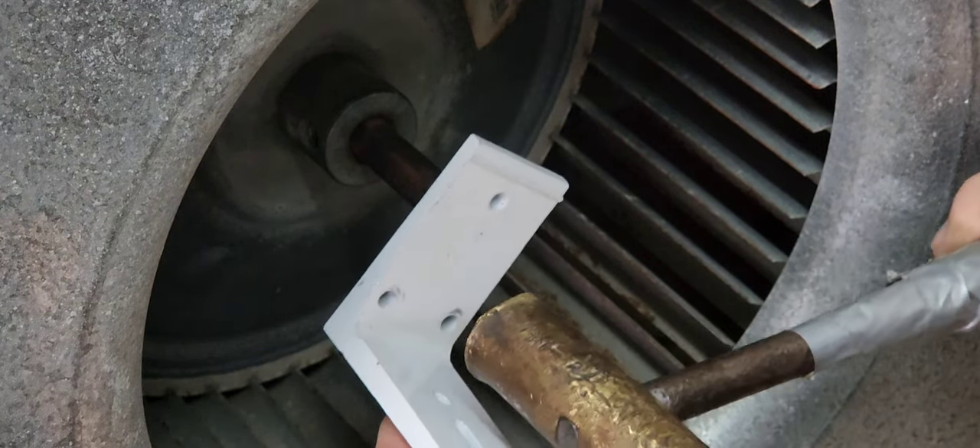Let's re-support the end of the shaft with the vice grips and bring the motor over to the edge of the table. Support the bottom of the motor with your hand, then release the vice grip — and it falls right out. Here's our motor. When I go to spin the shaft it's very difficult — those bearings are gone. This thing should spin with your fingers. That was our fault 41.